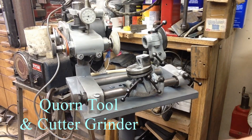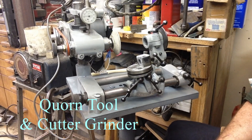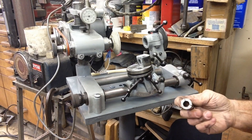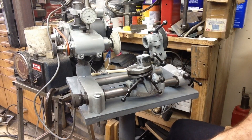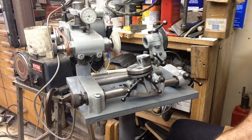Problems, problems, problems. Today I was going to turn my half-inch bushings for the Atlas tool holders for the little turret tooling, and I got my half-inch 3C collet in yesterday. I set it up in the lathe and discovered that I could not feed a piece of half-inch stock through my drawbar. It's half-inch ID tubing — I checked it with a stainless rod and thought we had clearance, but I was running cold roll with mill scale on it and it would not feed through.